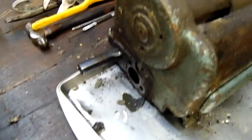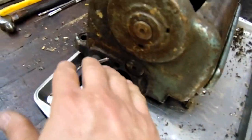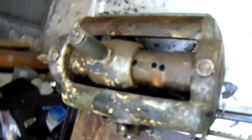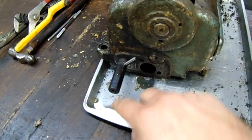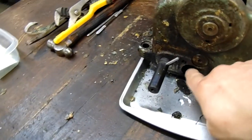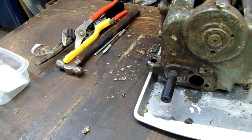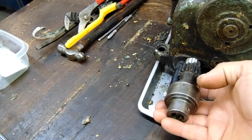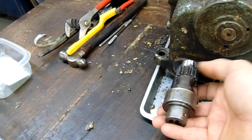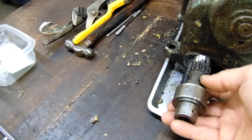I just want to add to the gearbox here when we were taking this apart. This is the front and the top, and this is the end where you have your drive screw and your lead screw coming off. The lead screw just keys into this because it actually runs off of the drive screw. This drive screw has a clutch assembly on it with the gear that runs your lead screw. The lead screw gear slips in and out of this if you need it to.